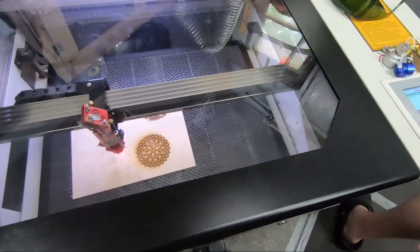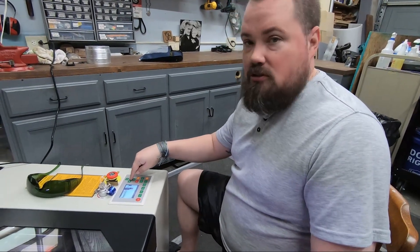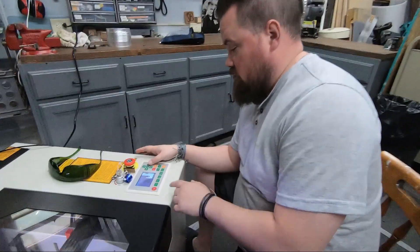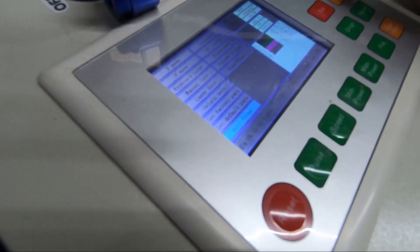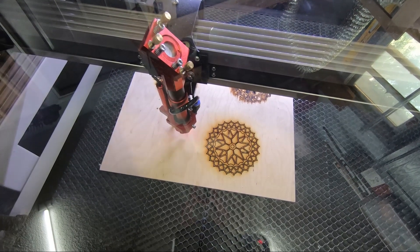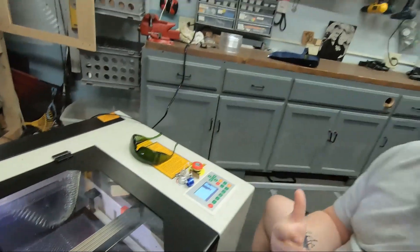I also figured out the auto focus. I'm going to use it on this piece — we'll test it later with a ramp test to confirm the correct focal length, but we'll have to do that another time. To use it, you hit the ZU button like you would to adjust the height, and on this menu auto focus is down at the bottom. You scroll down to that, hit enter, it goes down, the pin clicks, and it goes back up to its preset focal length.